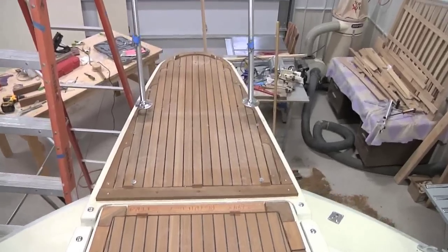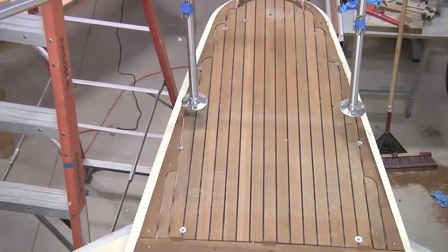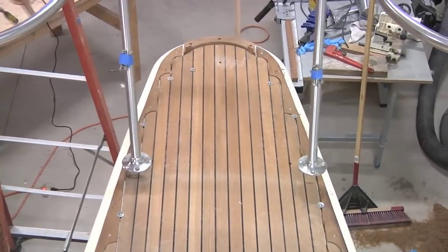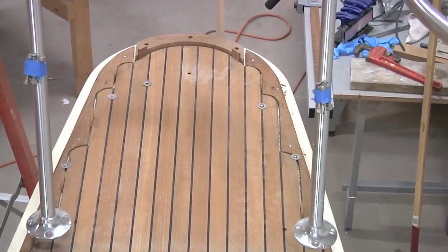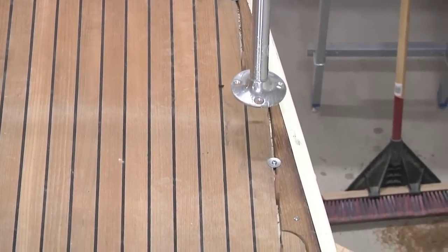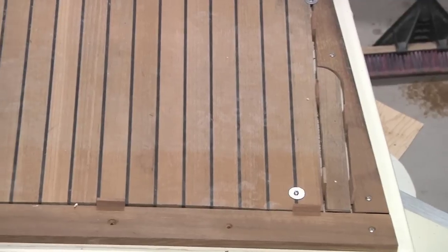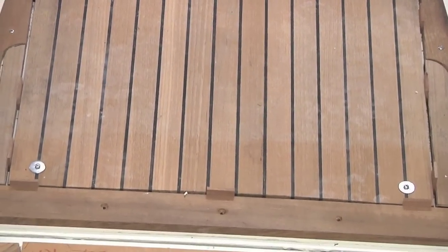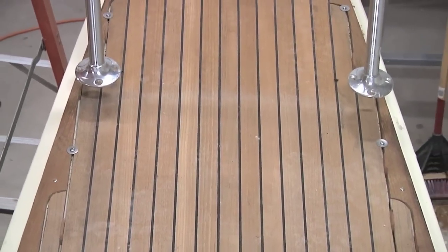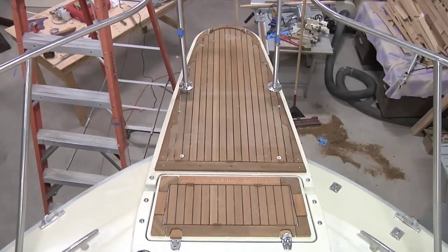After going back and forth a couple of times to make sure the spacing is just right, this is what we've come up with — this is the final dry fit before we decide to go ahead and mount everything. If you look closely, the main panel itself is being temporarily held in place with some screws and fender washers, and these screws are being put through the caulking lines, not through the wood. This will allow us to back these screws out after the epoxy has set, come back in with a small syringe of seaming caulk, fill in the hole, sand it all off, and you will never know those screws were there. The only screws permanently mounted will be along the border trim.